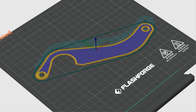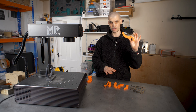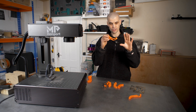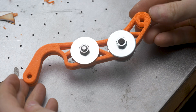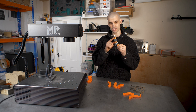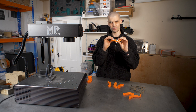The first design is just a standard 3D print — five walls and 50% infill, just the standard bracket. I've then designed another version with some trusses in between the hollow section. I haven't done any topological analysis to find the perfect place for these; I'm just drawing trusses in where I think the stress is going to be distributed. The next one is an idea I got from a Redditor — cutting out a steel skeleton and sandwiching it between two 3D prints, just splitting the bracket in half with some bolts to keep it together.